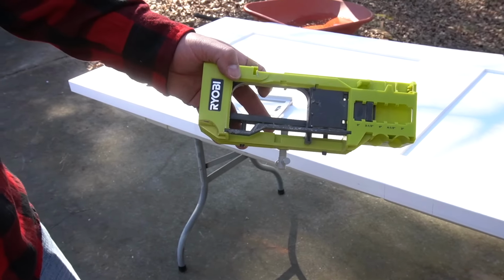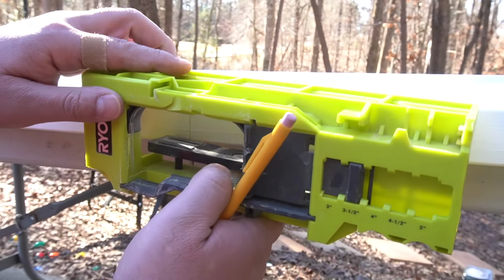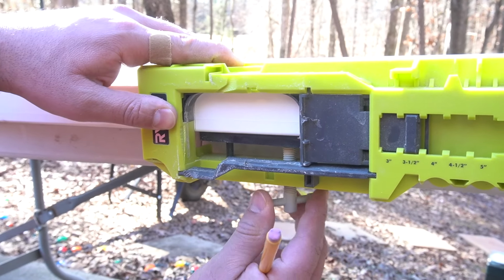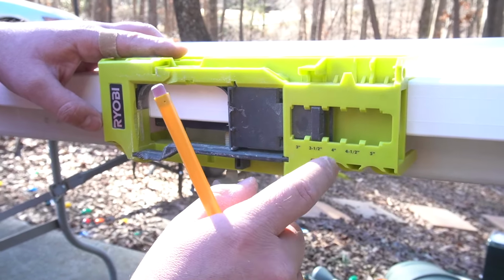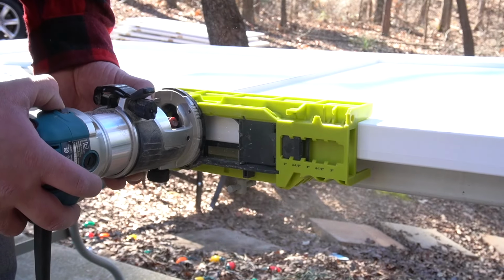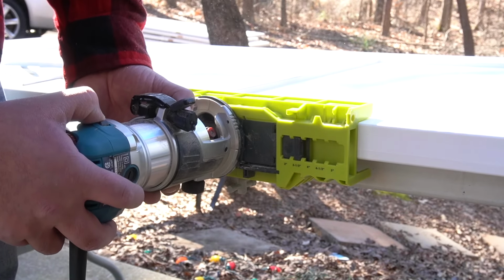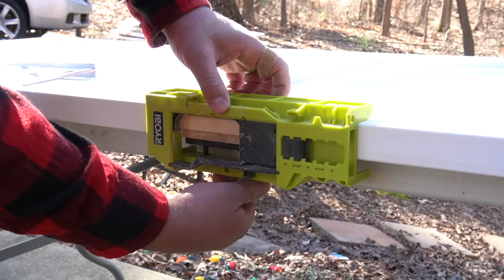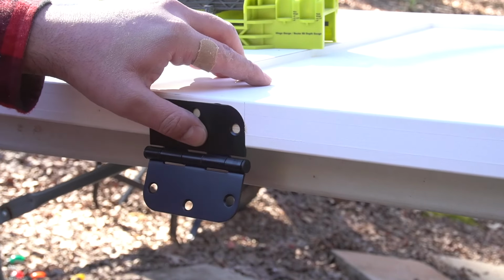So next you take what is called a router jig, and we'll make sure to link all of these items in the description box below. And we're going to line that opening on that jig to match up those lines he has just created. And then we screw it in place so that it doesn't move. Right, and then this jig, depending on the size of your hinge, 3 inch, 3.5, 4, 4.5. So whatever size hinge you're going to use, this little jig adjusts to it. And then with the router, you proceed to cut out the hinge indentation. And if you do everything correctly, you get a perfect fit.